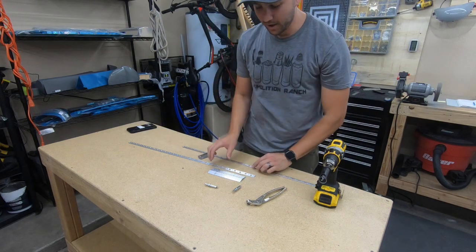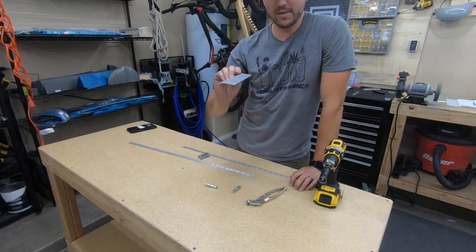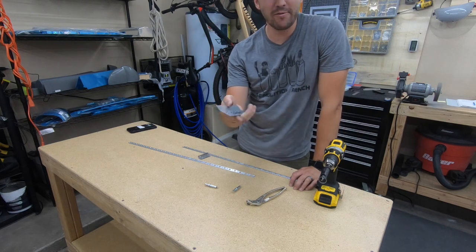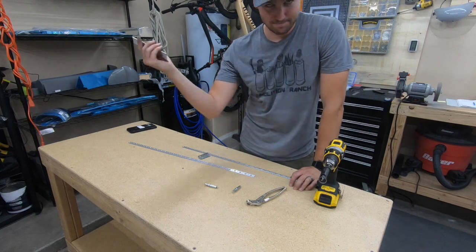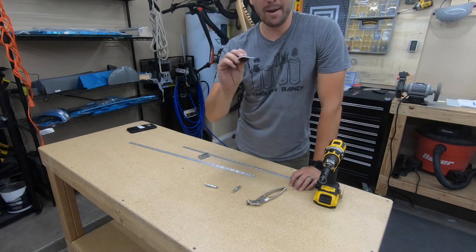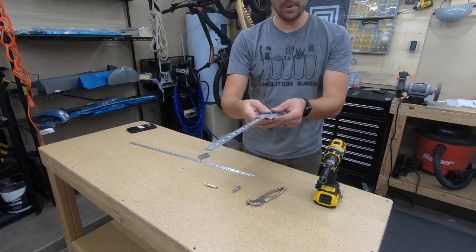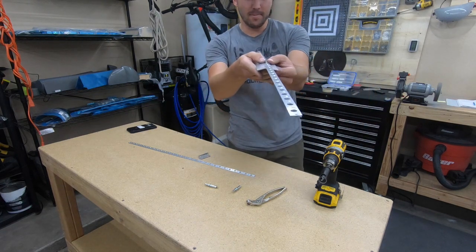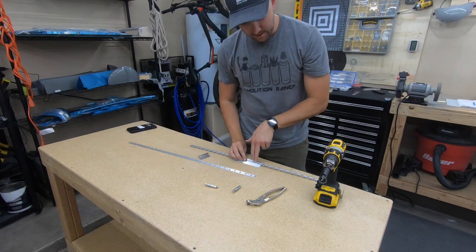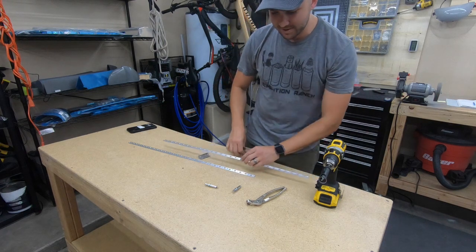So what I did on the rudder build was actually took a piece of this cheapo carpet transition strip stuff for homes. Anyways, the previous owner of the house left some behind. So it ends up being the perfect angle to not only hold the piece of material at that perfect angle where I can get a really nice straight shot at it with the countersinker, but also it holds it up off the table just high enough to leave clecos in.